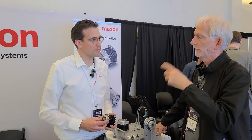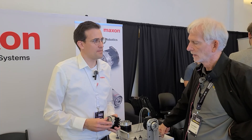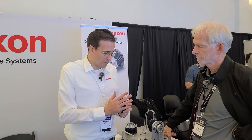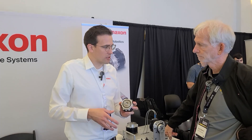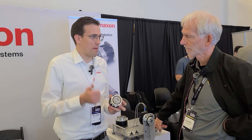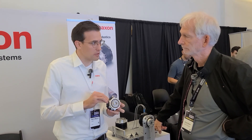So have you built the robot yourself or are you talking about other people? Other people are doing this. Tell me a little bit about that actuator and why I should be excited about it. This is our family of high-efficiency joints — highly integrated quasi-direct drive actuators, planetary geared, very dynamic, very efficient, very well coolable — so you have high continuous torques.